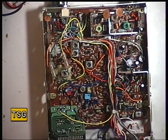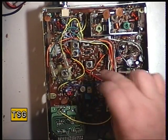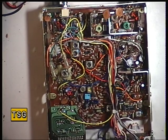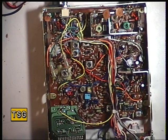Considering this radio has just come out of the carton from buying it secondhand in a batch, that's working beautifully. When you're working on these sets and setting the intermediate frequency coils and the little transformers here, you need to have as little signal on as is possible — that's the only way it can be done. You can't do it with a saturated signal. So you're backing off the generator as the set gets better and better.